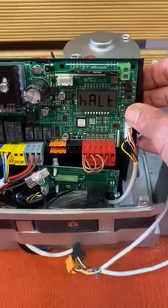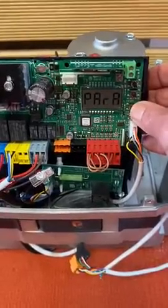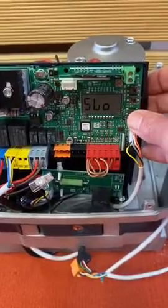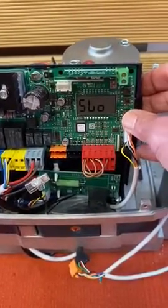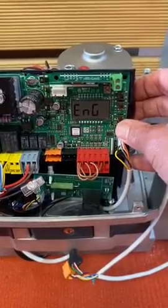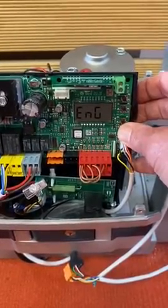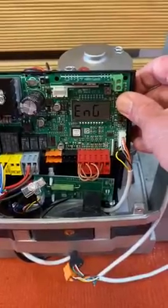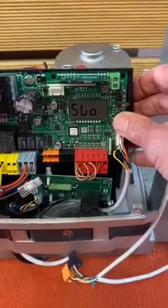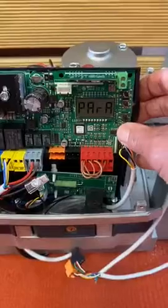In this case it's saying HALT, so at normal speed we will hit the OK button two more times to go to PARAMETER. If you do hit the OK button twice quickly and the word LANGUAGE comes up, you're accidentally entering into auto setup. To get out of that, hit your plus and minus button once to go back to the start. So let's restart: hit the OK button quickly twice — HALT — two more times — PARAMETER.